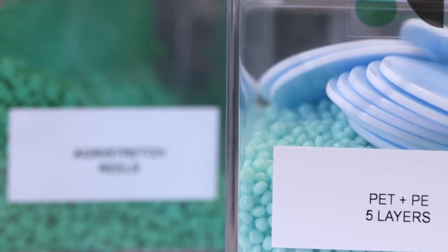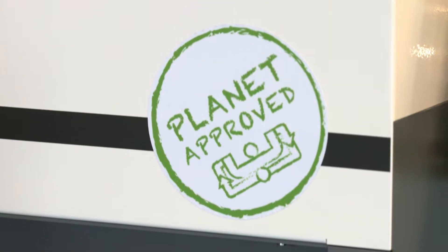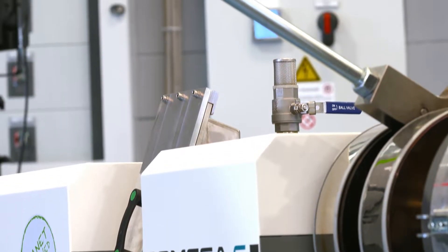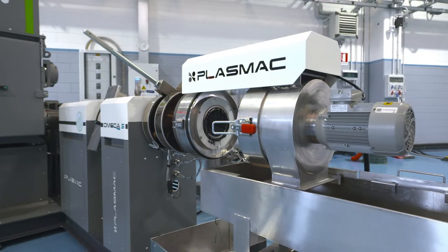The Amigas all use what we call short screw technology, or SST. SST means we apply very little shear to the material. The residence time in the barrel is reduced and we typically run the materials being processed at 20 to 25 percent lower temperatures than you would on the extrusion line. This means the material has an absolute minimum of melt history being put into it, a minimum amount of shear, and therefore by default the absolute minimum amount of material degradation takes place.